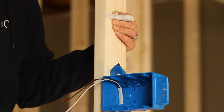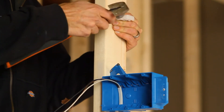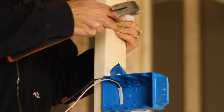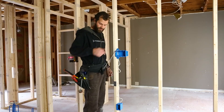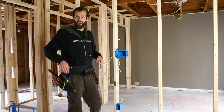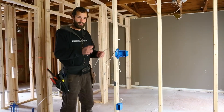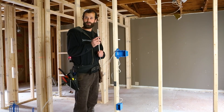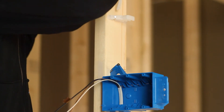I'm going to match the cable stacker to the face of the stud. You'll find cable stackers that come equipped with screws or nails. I prefer this because I'm utilizing one tool for all purposes versus carrying more weight or bending and picking up other tools. Now I'm using my 14/2 non-metallic cable again and I'm going to be routing this into my box.